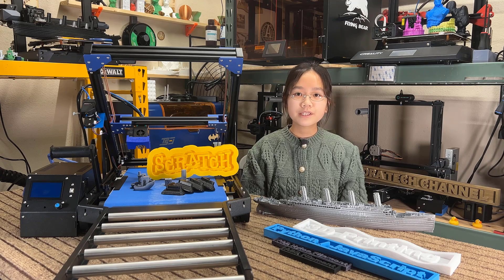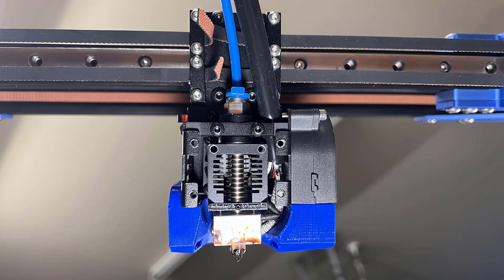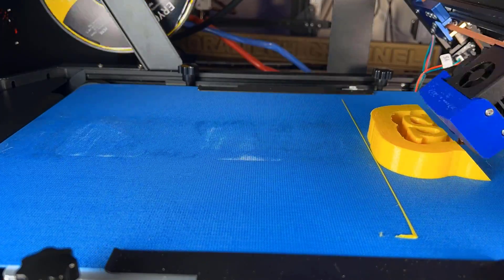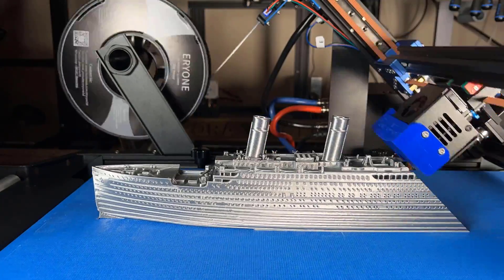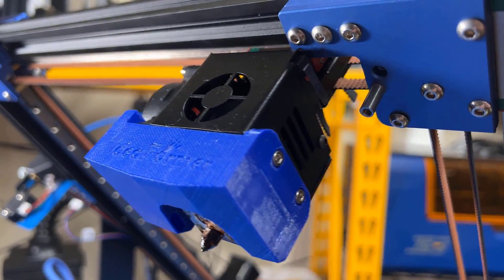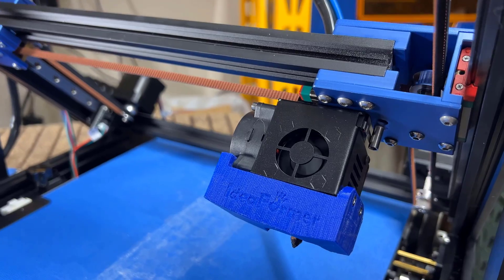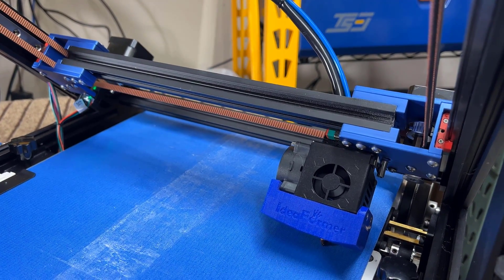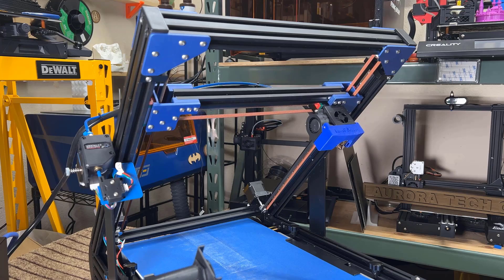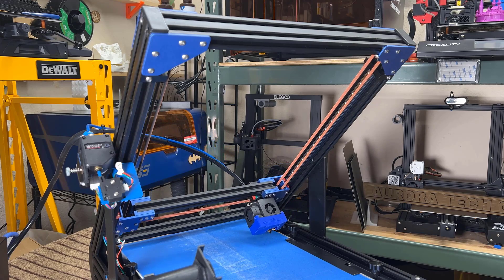Let's talk about the pros and cons of this printer, starting with the pros. First, compared to the original IR3 version, this IR3 V1 has been upgraded with an all-metal hotend that allows you to print a broader range of materials other than just PLA. The print quality with PLA may still be the best, but it is always better to have a nozzle that can print at higher temperatures. Additionally, the X-limit switch of the IR3 V1 is installed at the right side of the gantry, so you don't have to mirror the model in the slicer anymore. Second, this printer uses linear rails on both the X and Y axis, making it the best motion system you can get from a stock conveyor belt printer, as most other similar printers in the market use rubber wheels.